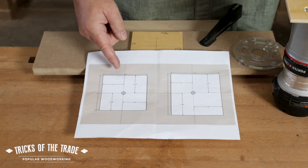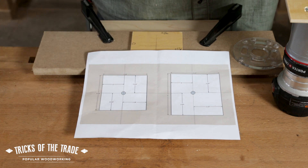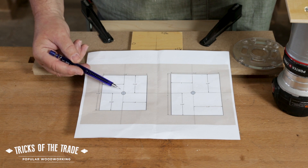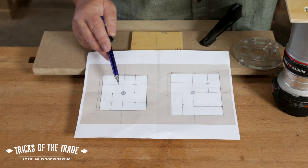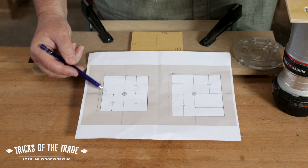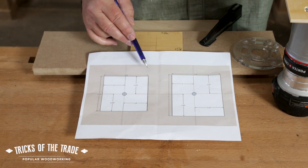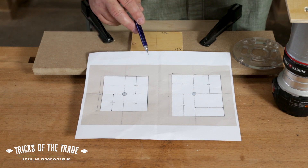The way you lay this out so that the hole is offset is to measure, in this case, two inches to the center from one side, and then two and a sixteenth down — that's your center. Because it's a rectangle, that makes the offset two and three sixteenths on one side and two and an eighth on another. So this is the zero cut, set to two inches — the side you'd run your fence on. Run the next edge and you get two and a sixteenth, then two and an eighth, then two and three sixteenths.